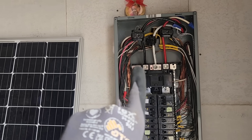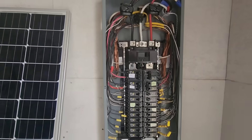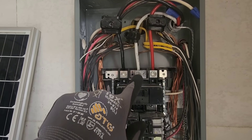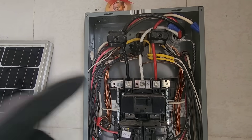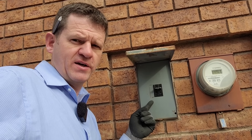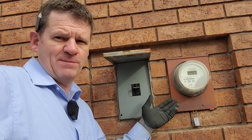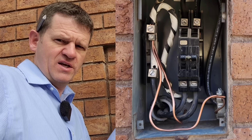When I was measuring between my neutral and my ground, I was getting a connection there. So I disconnected my neutral and measured continuity from the end of that wire to my ground — and I did have continuity. With that neutral disconnected and no ground neutral bond present in the panel, that confirmed what my electrician said: there is a ground neutral bond in my meter. Sometimes your meter might have a ground neutral bond, but that's not up to code. The ground neutral bond needs to be in the main disconnect. So I went ahead and added my ground neutral bond in that box.